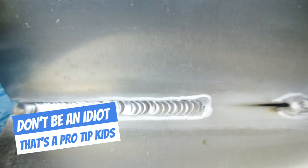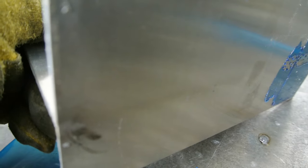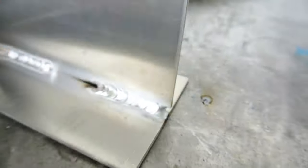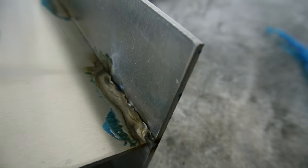These ones turned out pretty good. These are the two welds that we did and they turned out not half bad. On the backside underneath, that little bit of discoloration is the penetration. With that eighth-inch aluminum, you're going to find this when you're building your boat - it's really easy to burn through, just like that, and now you've got all kinds of problems. We didn't have proper adhesion between the two pieces. We had too much heat in the upper piece and not enough in the lower one, and we had bad fusion. That's a bad weld. This one, not too bad.